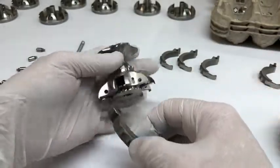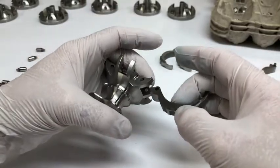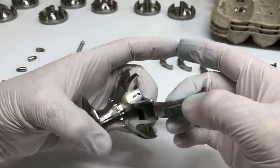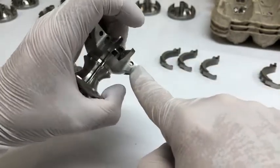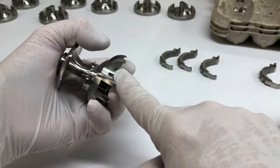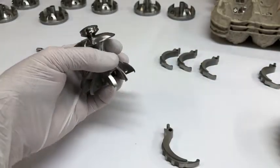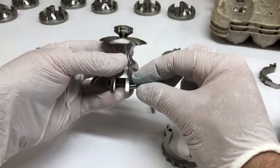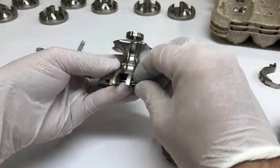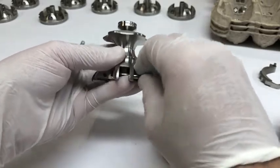Each of these arms has to go into its respective slot. When I drilled and reamed these holes, I reamed one side all the way through and the other side only part of the way through. So you'll see these little pins can only go in — if you're holding it facing you — right to left, and they're still a pretty snug fit.